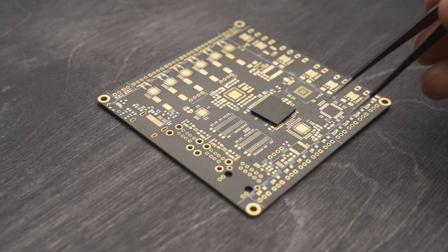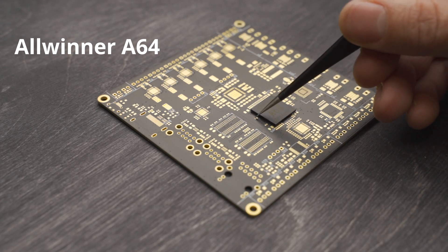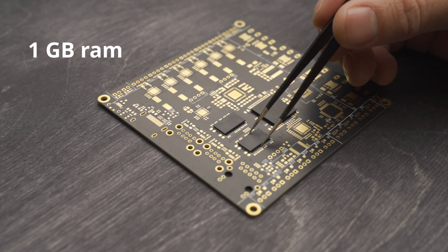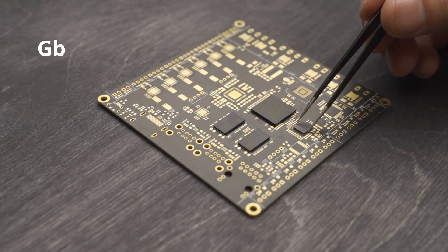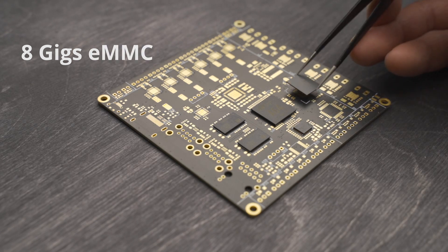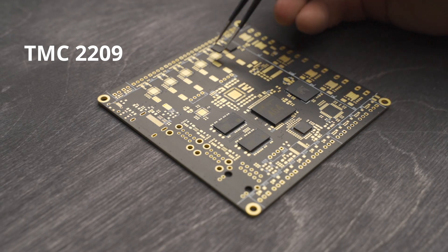The big news is that this board uses a different SoC altogether, which brings both opportunities and challenges. It's now a 64-bit AllWinner A64, quad-core, with one gigabyte of RAM, Gigabit Ethernet, and eight gigs of on-board storage. Those are the main specs.